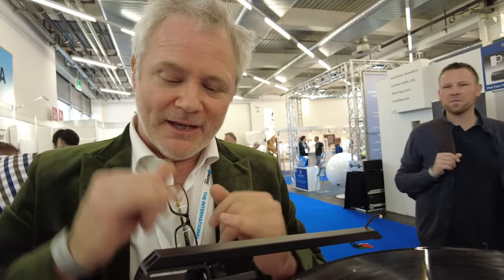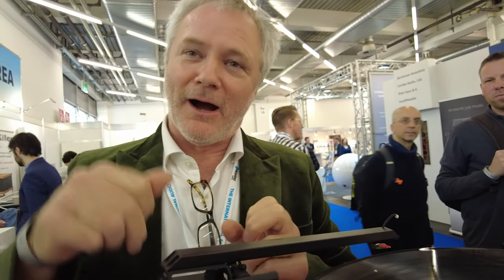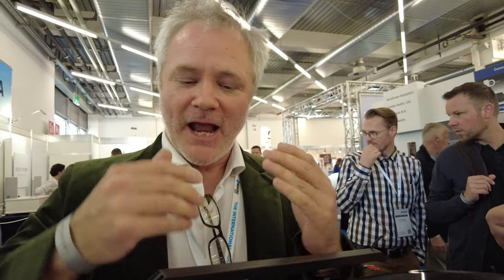Is it steel? The pivot point itself, initially they were tungsten, now they are high-speed steel. So they've got softer, but the reason is technical, to do with magnetism. The bearing performance is enhanced if you can magnetize the pivot point just a little bit. A little bit of magnetic attraction at the pivot point. No chatter. It has no chatter anyway.